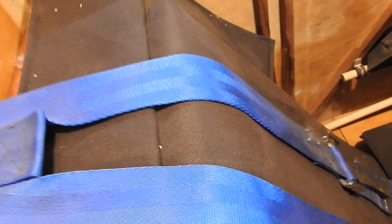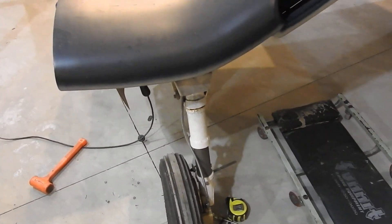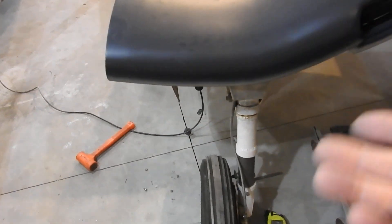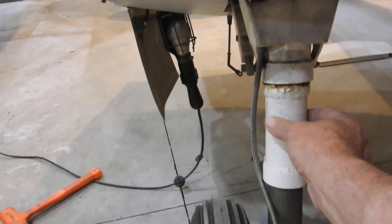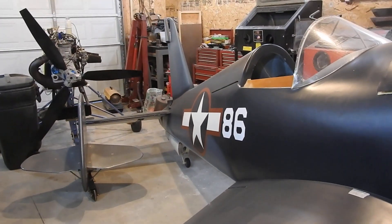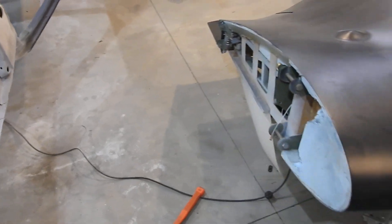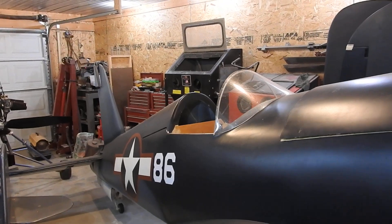That's going to be the short but sweet update for this week. Things outside — poplar seeds are flying, so I still got to pull that tank and touch up some paint. That's kind of one of the big setbacks right now. Once that's done and I hang this up and do a gear swing, get everything adjusted, then I've got to cut out the little gear door attaches here and here. Then those will be done. Tail wheel just needs to be basically tested and rigged, make sure the doors close okay. I did get a piece of aluminum to make the trim tab for the elevator. This aluminum is for making the front gear doors and the covers for the bottom of the wing openings where you can access the hardware to pull the wing off — about a four-inch wide cover, three foot long, both sides. And I got enough to make a frame around the windshield bow out of aluminum as well.